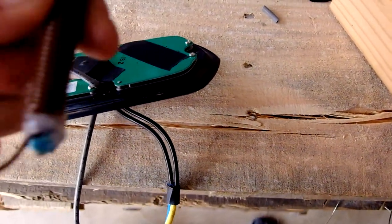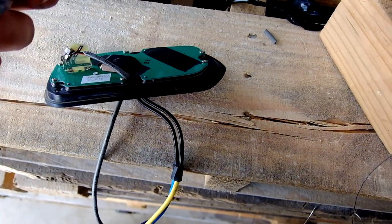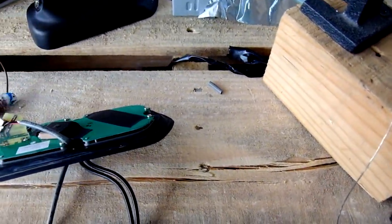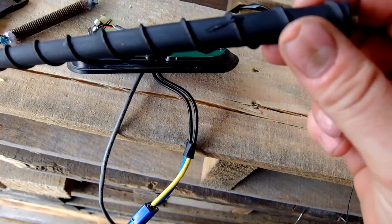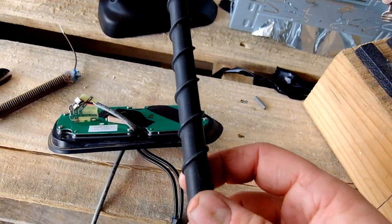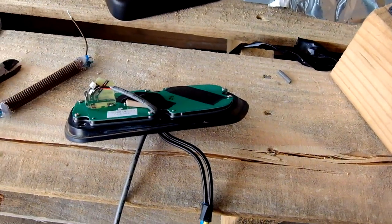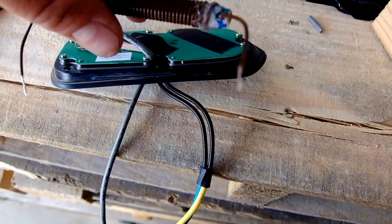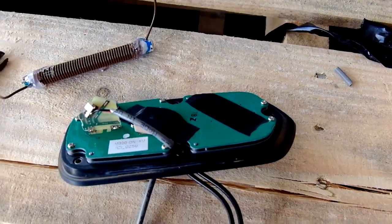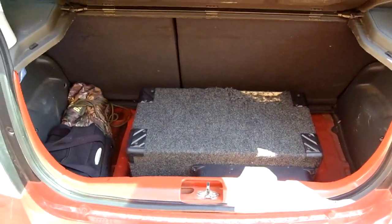I made this coil on a piece of pencil wood — I didn't have a dowel and didn't feel like going to buy one. This is basically the load which is going to give the gain. The actual antenna has a helical shape on it but I don't think that's functional — I think that's just for looks. I think it's just one long piece of wire on the inside and there's no way of actually taking it apart to know for sure. I'm going to solder the end of this coil to the wire coming in, and then solder the other end to the inside where it screws on. It'll all be buttoned up and you won't even be able to tell.